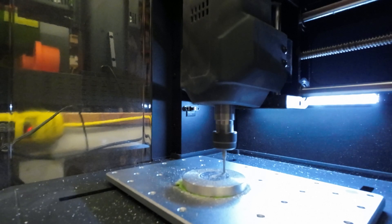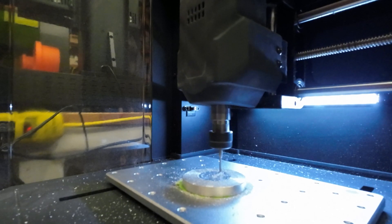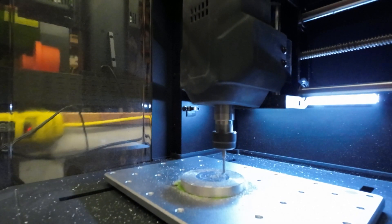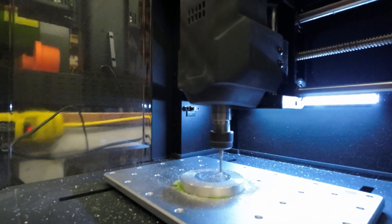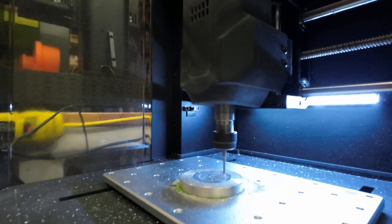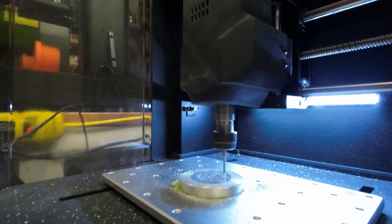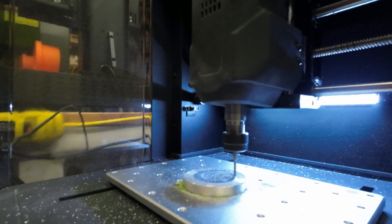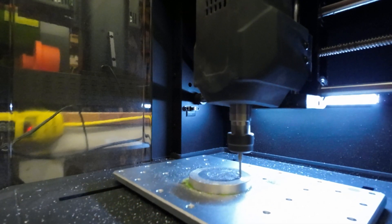I had a little bit of aluminum laying around and found a flat cutting edge bit — looks like it was made more for plastics and acrylics. I figured I'd try it on aluminum to see how it did. You can see my speeds and feeds are a little fast for this bit — I didn't take time to work the settings out. When it makes the lap, the bit is kind of dancing a little. Definitely not good speeds and feeds for that. It can engrave aluminum with the correct bit; I just haven't had a chance to dial in those settings yet.